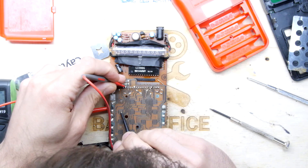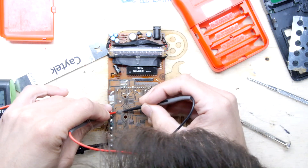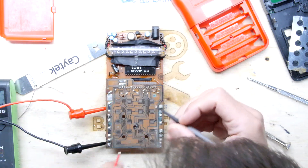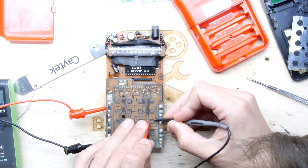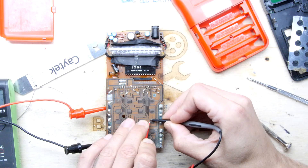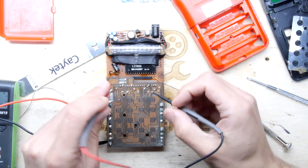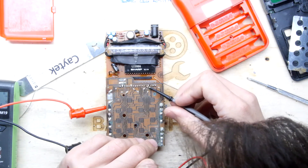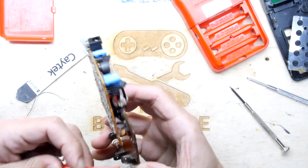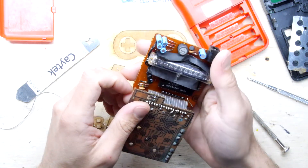Just one last quick experiment before I sort of give up on this — the reason I'm giving up is because I'm kind of busy with other stuff; I just thought it would be quite a quick one to do. This membrane stuff doesn't seem to even give continuity through it. That is so odd — I'm actually just touching even on the same part of the same thing. Oh yeah, I suppose it isn't giving continuity but it's just because it's reasonably high resistivity, so you probably have to measure its resistivity rather than continuity if you're testing that. I could buzz through this, but what I'm probably going to do on another day is just remove the whole keyboard membrane, just in case there's something a bit doolally with it.